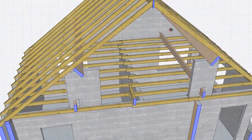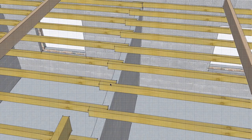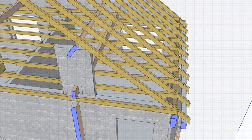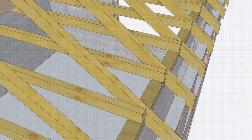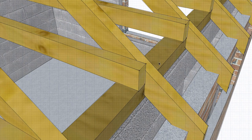That's basically how a traditional roof works. If the ceiling joists are supported on an internal wall, as they are here, then they are nailed together very securely, because remember that these ceiling joists are in tension, resisting roof spread at the wall plate. Another feature of this roof is that at the wall plate, the rafter is nailed both to the wall plate and to the ceiling joist, and the ceiling joist is also nailed to the wall plate — giving a very secure connection, because this is resisting the rafter pushing outwards.